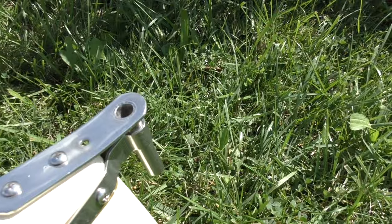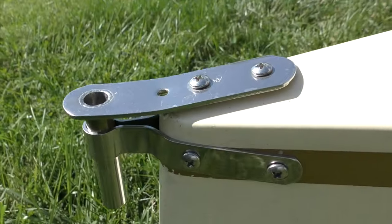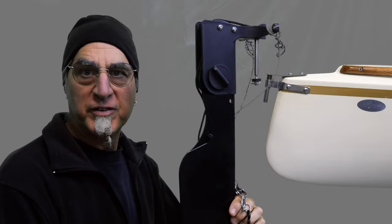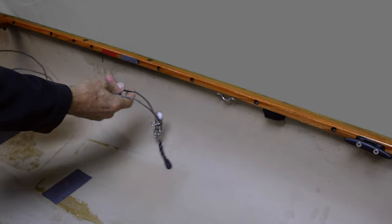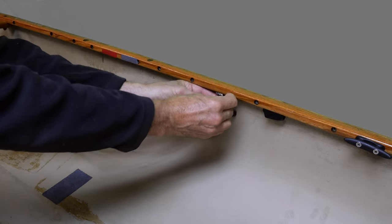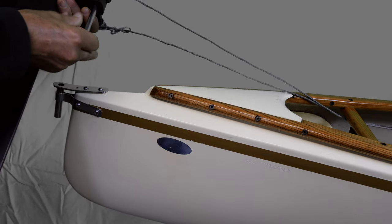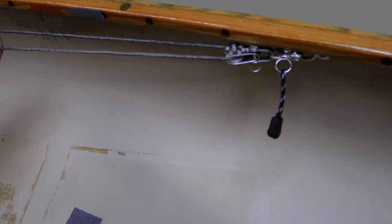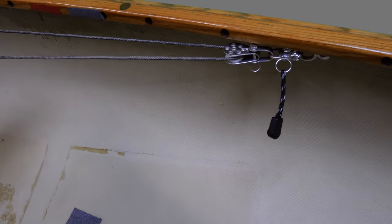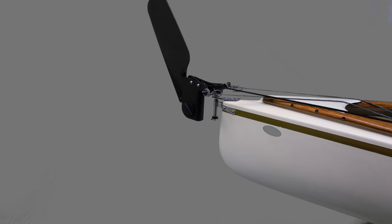A stainless steel gudgeon is mounted to the stern of the boat, and behind the screw mount is aluminum backing with fiberglass-reinforced resin and cloth. For the rudder, I have non-stretch line running to the rudder tillers, looped with a pulley, running the pulley forward and connecting it to the gunnel, then bringing it back. Slip the stainless steel pin into the gudgeon with a locking ring, and pulling on the line operates the rudder left to right. The rudder has an internal spring that keeps it in the down position, and pulling up on the line will raise the rudder blade.